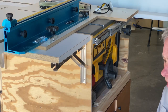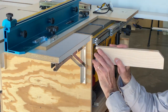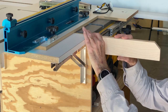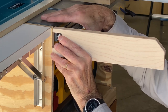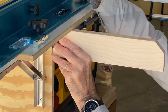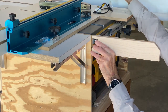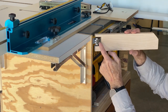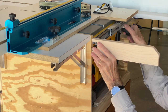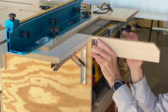The first thing I had to do is figure out where this support was going to fit on my table. I knew right here on my cart I could use the edge to support that piece and bring it up level with the table of my saw, so when I would slide back my cross-cut sled it would slide right over the top of this. Once I knew how to make that and how to cut that groove out, you can see why I needed that groove — so I can continue to adjust my fence back and forth without bumping into it.